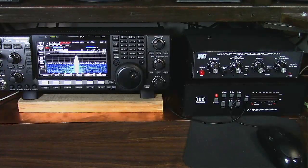I've heard on Facebook and other internet sources that people claim a noise canceler can only cancel a single noise at a time. This demonstration will show otherwise. I'm going to null out WWV on 10 MHz — right now it's coming in very well, about 20 over 9. The noise antenna I have is 65 feet of wire helically wound on a nine-foot carbon crappie fishing pole, strapped to the side of my fence where I can pick up RFI from my neighbor's home.